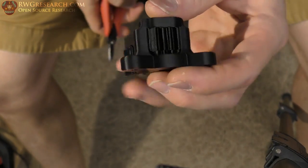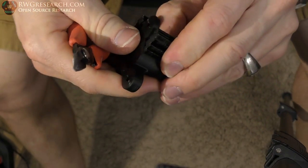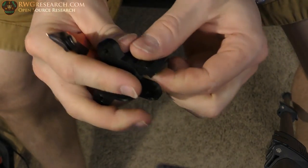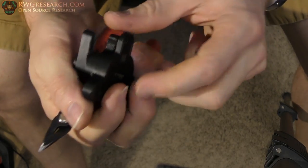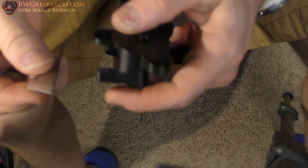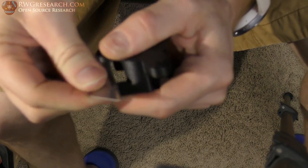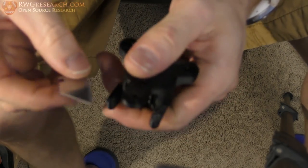So here's what the part looks like. I did have some support, but this printer, when you get everything calibrated right, does really well. The reason I'm not using my other Delta is because the Delta that I built originally doesn't have perfect axis symmetry, and so it's really difficult to get that thing exactly where you want it. So I tend on using pieces that I need to be perfect, which I printed the end effector on there also to make sure it was also symmetric and proper.